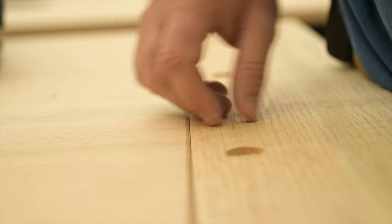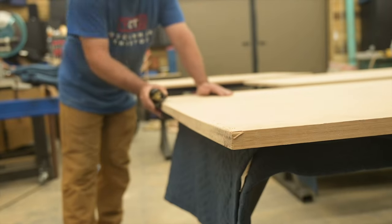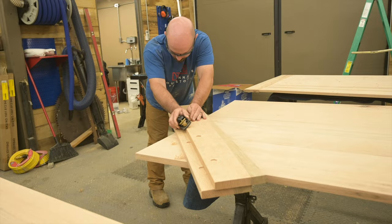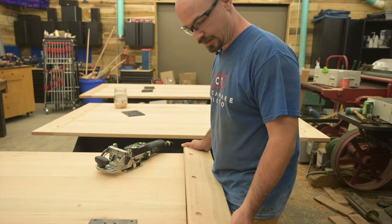So here's the plan. One of the things I did to help draw your eye away from noticing any inconsistencies was put a light chamfer on both of these — I chamfered this side and chamfered this side — so we have a little divot, and if there are any irregularities it's not going to pop out to your eye. I need to get new tracks for my track saw, so this table is dipping in a little bit from when I cut it.